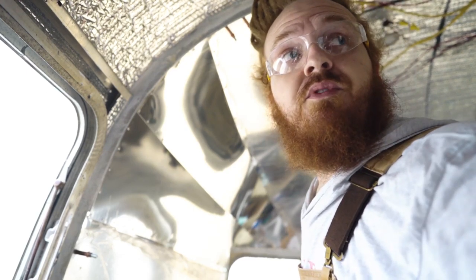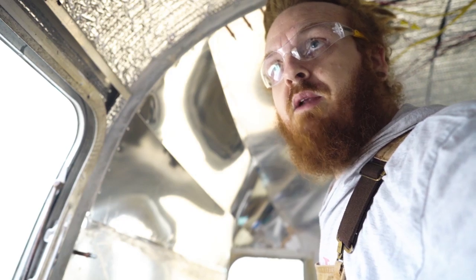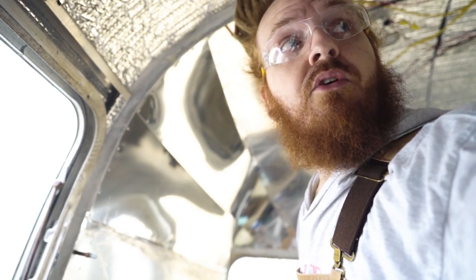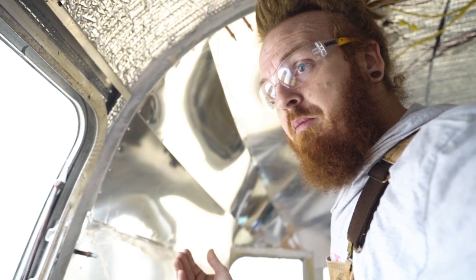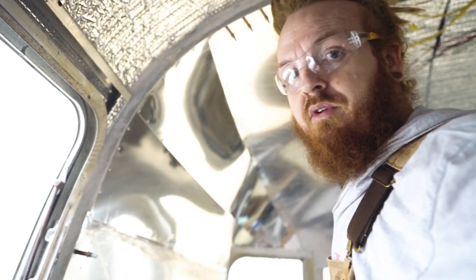So I've got some Zephyr Pro 50 Eliminator that seemed to work out fairly well. Any other products that I've tried so far, and you've got to be very mindful of what you're putting on aluminum, have been kind of a pain in my butt to try to get off. That stuff is non-corrosive, it's descaling, and it's a multi-purpose cleaner. It's a little expensive at $25 for 32 ounces, but you can buy it by the gallon as well. It seemed to get it fairly clean, but most importantly, the product comes clean itself, versus an alcohol or anything else that you're gonna constantly fight with a haze or something.